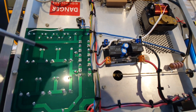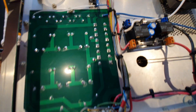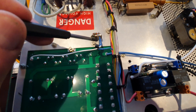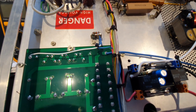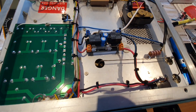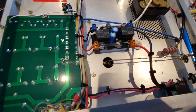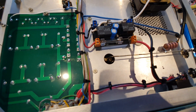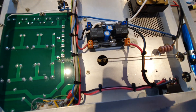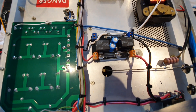As per the previous video, this is the power supply board which I've just added. I just neatened up the metering board, desoldered that wire, and then cable tied and did a better connection of it. So whenever I see any sign of the covering of wires having shrunk back five mils, I will remove, re-cut and re-solder, and install with heat shrink around it as well if I can't get a nice looking connection.